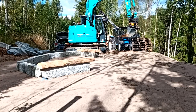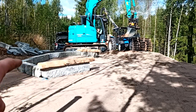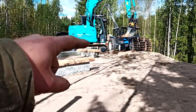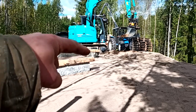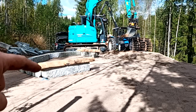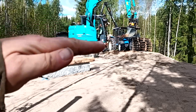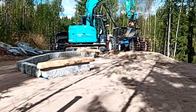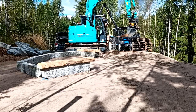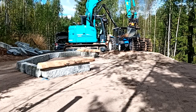Now what's actually happened, effectively by accident, is that the back wall here is slightly lower than the front, but we've checked all the levels, and for instance this front, this point and this point are the same, that point and that point are the same, that point and that point are the same, but the whole foundation is slightly slanted down to the back, which is great. I'm really happy about that. It emphasizes that whole theme that we've got going with this building, with everything sloping up to the front.